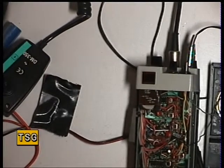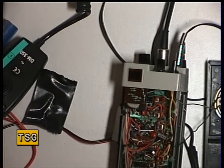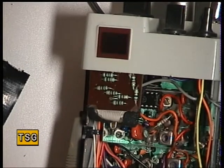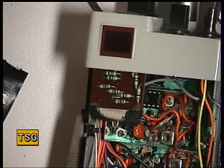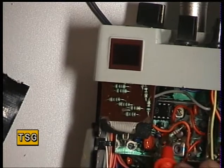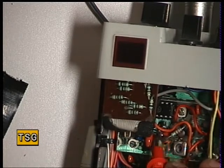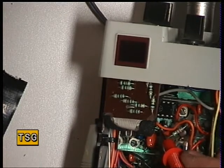I've got the service manual in front of me. It's test point number 3, and we measure it on channel 40. There's a little purple thing on it — that is the test point. What you're looking for is 5 volts on transmit. So we're going to transmit — which we've got. And we've got 5 volts on receive.